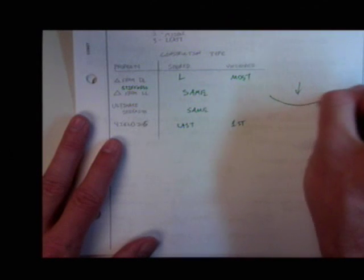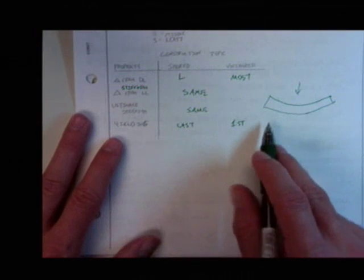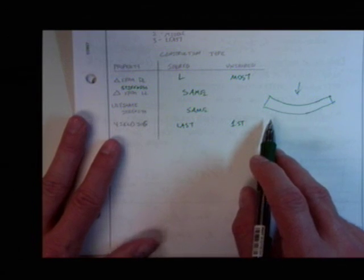So when does it make a difference? Well, when you pour that concrete or whatever on top, you want to make sure that your deflection is not too excessive, right? Because you're increasing dead load, it's costing more concrete. Lots of other issues. Okay?